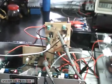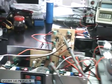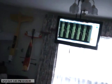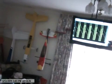Now there's some rather complex electronics, and I will attempt, after the video, when I present this on the forum, to draw up a schematic to show where and how this is wired. And if you have a careful look up here, I have a digital oscilloscope up on the flat panel LCD mounted on the ceiling, and you can see a very high amplitude sine wave. That high amplitude back EMF sine wave presented up on the screen, I'm going to short out to the battery supply.